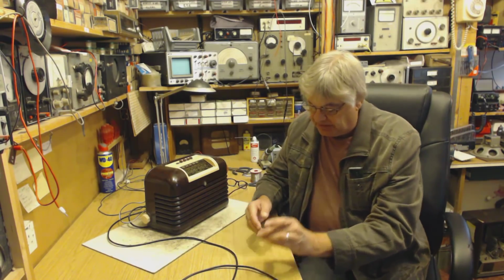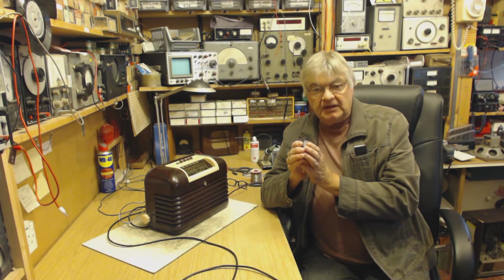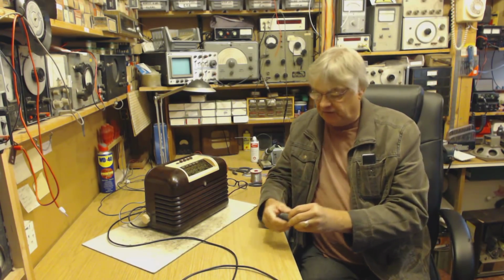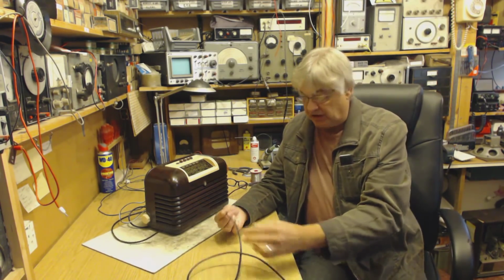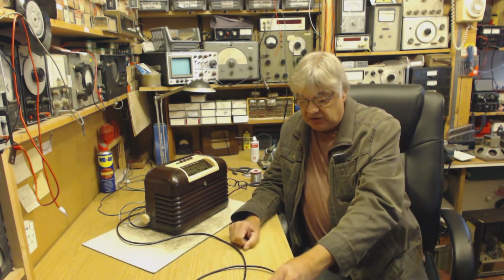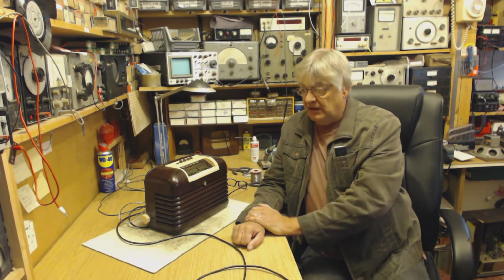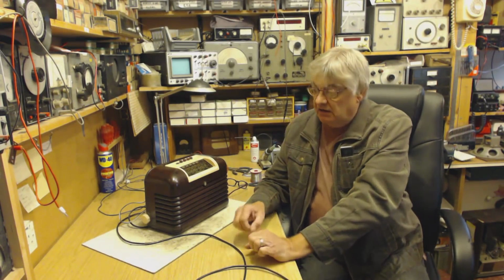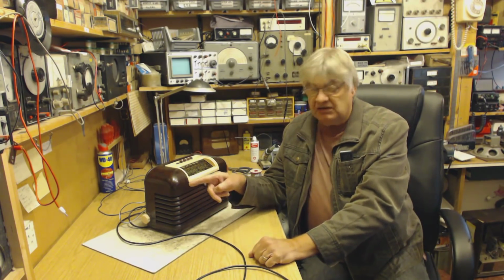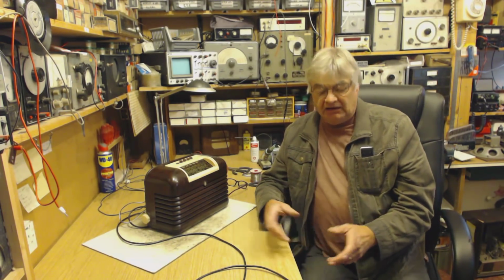That's the answer there. But some of these do have an earth line inductor to stop the earth bringing up interference, acting like an aerial. Is to block RF, basically, as we have done. Remember about the live and neutral, the coils, the capacitors, stops RF coming into your radio. Well, you can also do that on your earth wire, stops RF coming into the radio from the earth wire. But I've got to say this again, don't play about with the earth connection at all on any equipment. Okay, and certainly not on your house wiring. Don't go taking the sockets off the wall and mucking around in there.